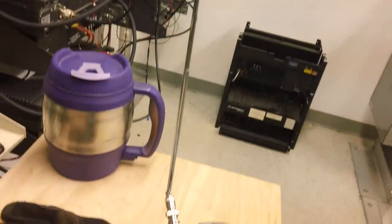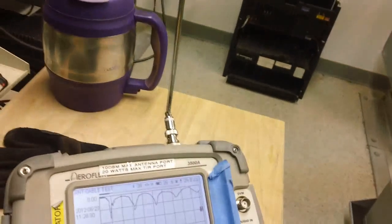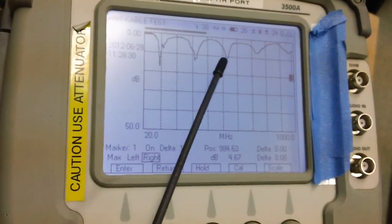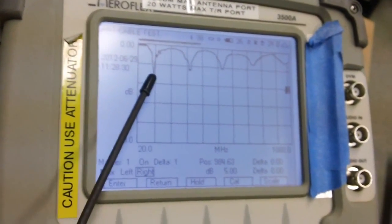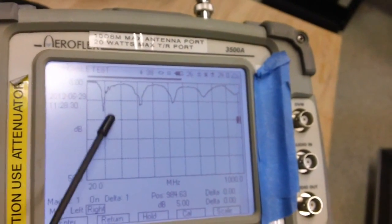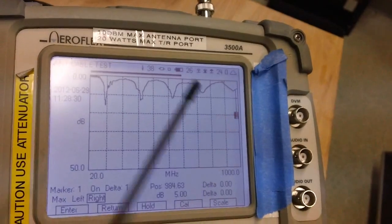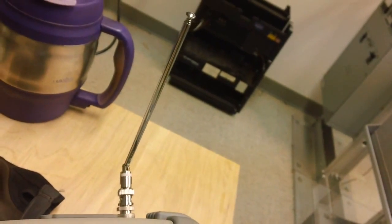In comparison to these telescopic antennas that come with a scanner - if you get a new scanner it'll come with a telescopic antenna - look at the frequency response of that particular antenna. It's not a straight line like you'd see in a disc cone antenna; you get these deep valleys and hills, where the valleys are where it's resonating. It's not consistent throughout the range of the band. Lowering it down, that looks like it would be tuned to UHF.